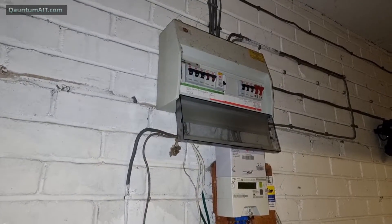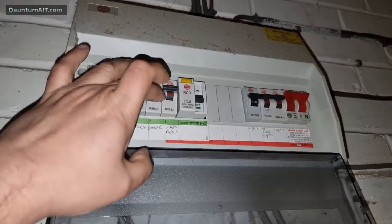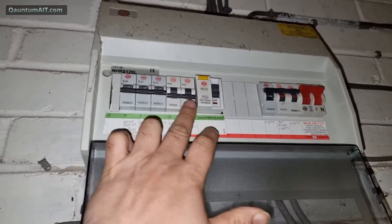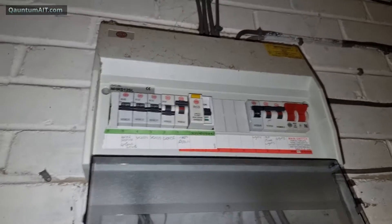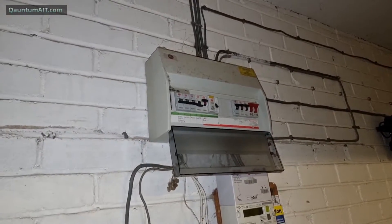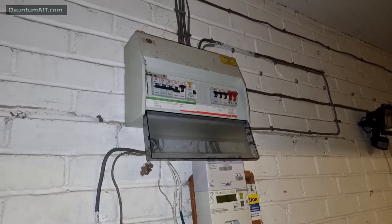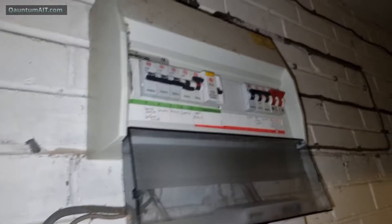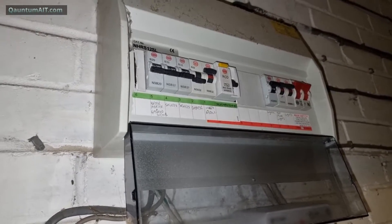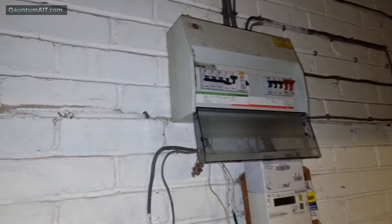Something plugged in downstairs. Turn everything off, put that on, and just turn the downstairs socket on. Oh, it's tripped. Alright then - problem with the downstairs sockets. Something plugged in, or there's a ground to earth leak - some milliamps. That's what trips the RCD; there's a leakage. Something plugged in that's leaking current to ground - that's what trips the RCD.